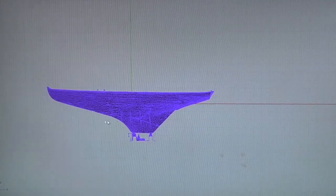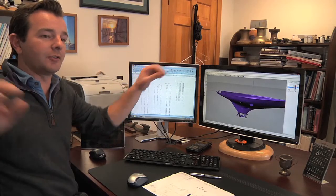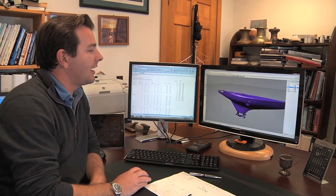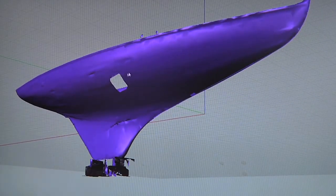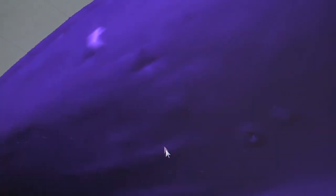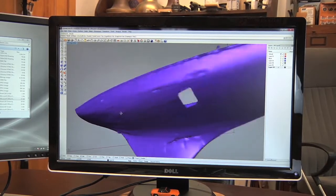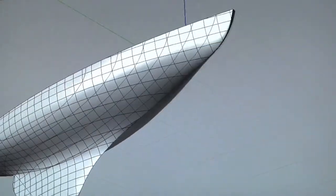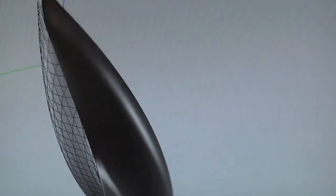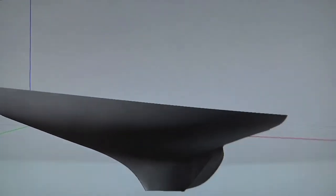Over time — over a hundred years — the ends have dropped down, creating a flat sheer instead of that beautiful curved Herreshoff sheer that you would see. The 3D scan even shows us where there were hard points in the planking or unfairness in other areas. With that information, we know exactly what has to be fixed. Here's the finished product that exactly matches the original design model — and that's our goal, to return the shape of the original boat to.